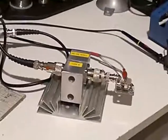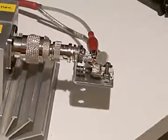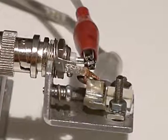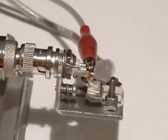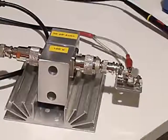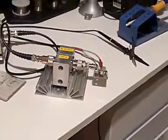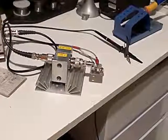The 30dB 100 watt attenuator is terminated with a 50 ohm, 50 watt load, which you can see. The two oscilloscopes are actually tapped across that 50 ohm resistor. So the 30dB attenuator has to be terminated in a 50 ohm load for it to be an accurate 30dB — otherwise the readings are wrong. That's how I've set that up.